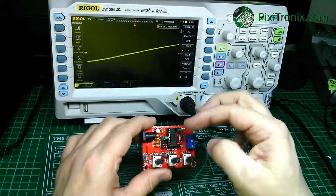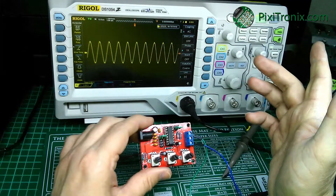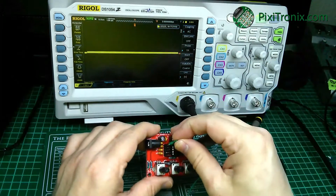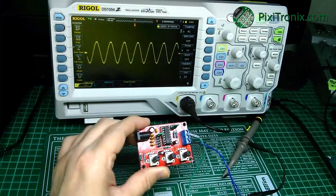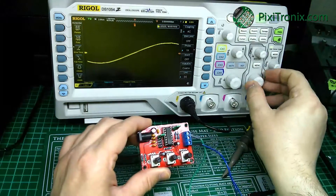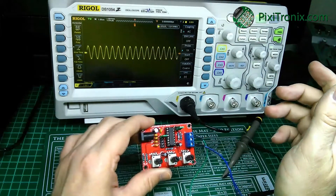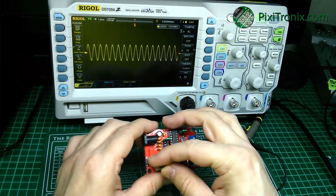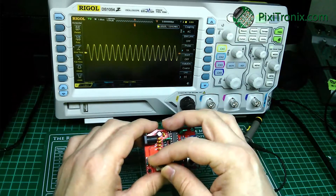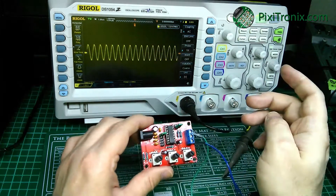This setting is getting 2.8k to 84k. The next one is giving 57k to 1.3 MHz. Our amplitude has dropped off a bit and we can only crank a maximum of about 2 volts peak to peak there.